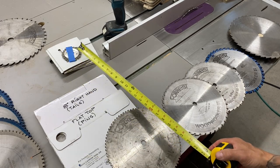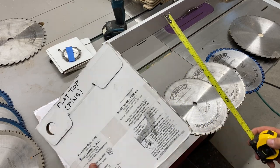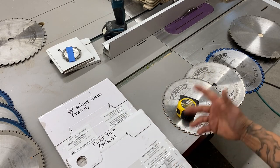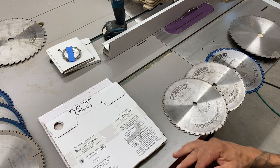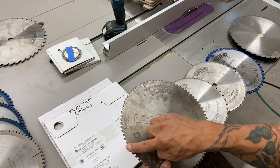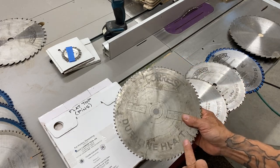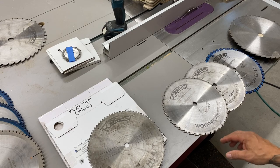Moving on to the next pile — I've got some scoring blades. These are my specialty blades that I cut dovetails with, so I have a flat top grind 10-inch blade. They're specific for cutting dovetails. There's the eight-degree right-hand blade — all the teeth are ground eight degrees one way. This is another blade I've been hanging on to for a long time because they cut so well. It's really toward the end of its life — you can see it's been sharpened numerous times, with very little carbide left. But this is another one of those Duraline high ATB grinds — also Forrest.